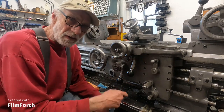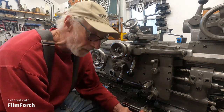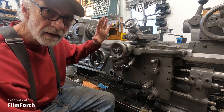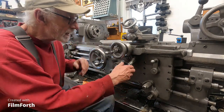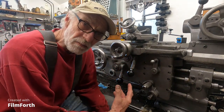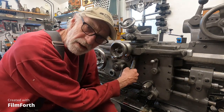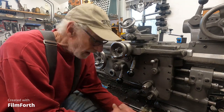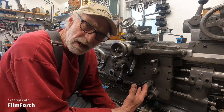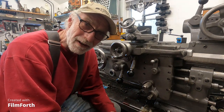That's especially important on this cross slide, because it has less support bearings and it appears that's caused a bit of problem. I have it adjusted the same - so I can feather it. Or I can really lock it in - there, I can't stop it. It's not adjusted more than it needs to be. But these levers - the way they had it, they kept messing with the adjustment. You shouldn't have to do that because the levers are real powerful. That's what busted those bearings - clamping them so hard, spring bind and all that stuff.